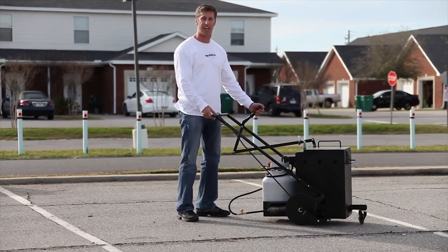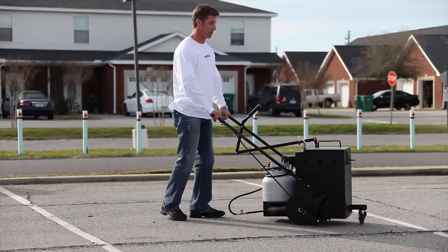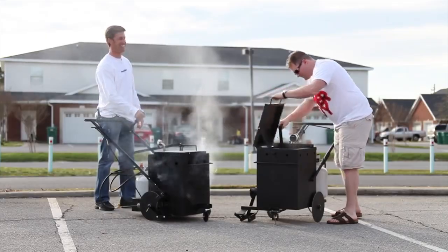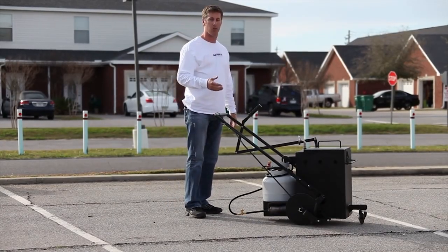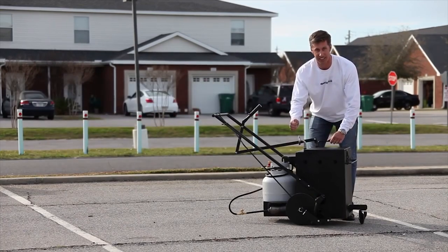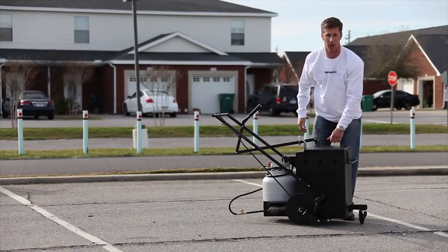The AK-10 has on-the-fly agitation, so you can actually agitate your material while you're pushing the unit rather than reaching in front and agitating it right over top of the main kettle. With competitors' units you end up standing above the unit having to agitate like that, and when you look into your unit all those fumes from the crack filler hit you right in the face — that's not good for you.